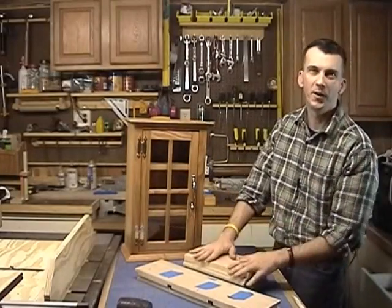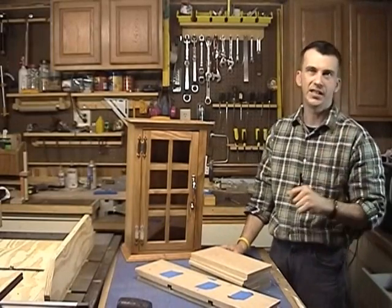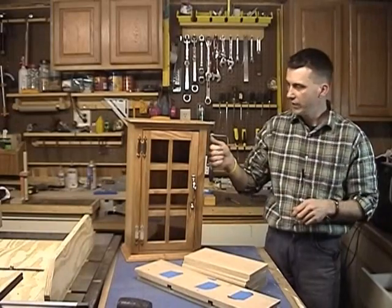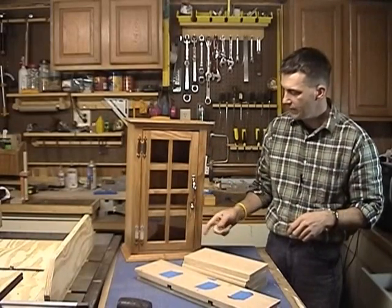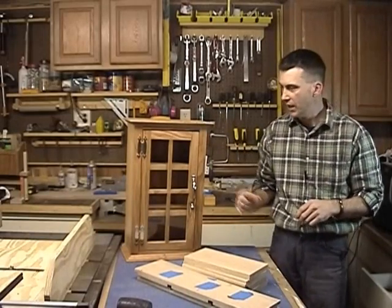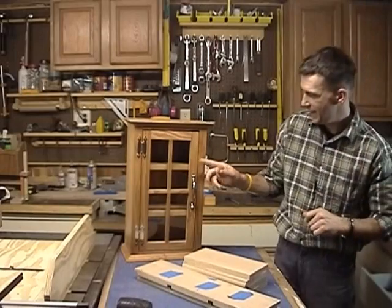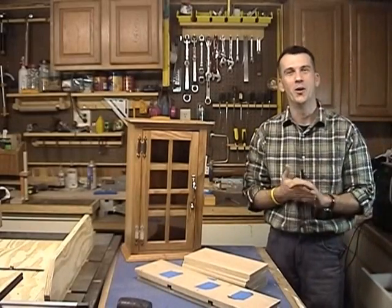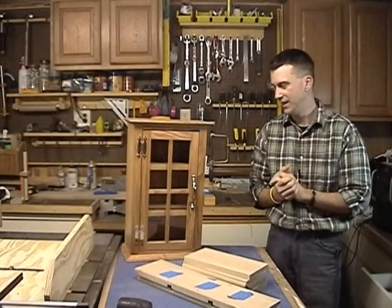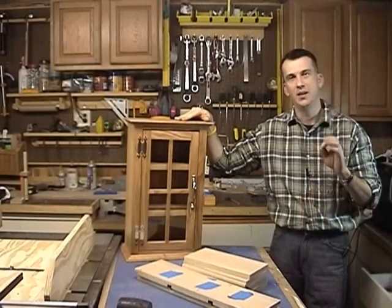Alright guys, we got all the parts finished for the case. Now all we have to do is pre-sand them, pre-finish the insides if you wish, and glue this case together. While the glue is drying, we can start working on the face frame, inset door, the buttons, as well as the trim. The face frame and the door are assembled with open slot mortise and tenon joints, and we're going to get to that in the next video. We're going to wrap up the project in part 2 of this video.